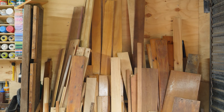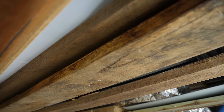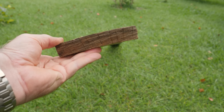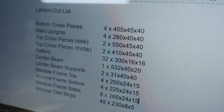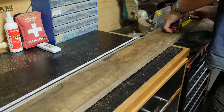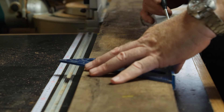I've got a lot of great wood that would have been perfect for this project, but instead I used some old hardwood planks that were hidden up in the rafters. Now these planks were warped, twisted and cupped, and nowhere near thick enough for what I needed them for. So I put together a cut list and cut everything down to approximate lengths, making it a little bit easier to work with. This also minimized wastage when it came to the next step of milling down the timber.